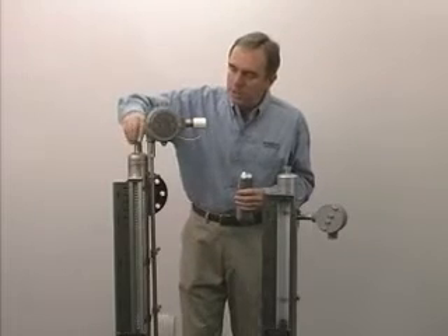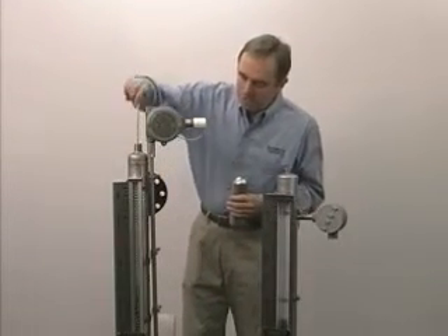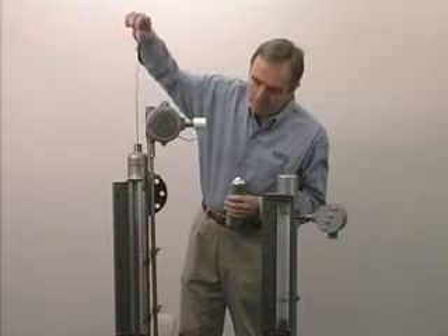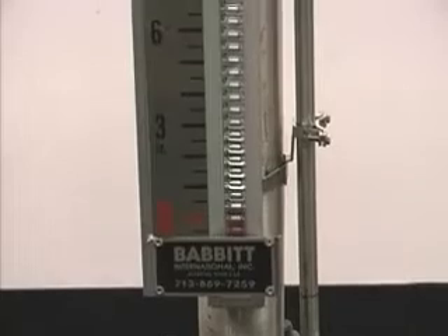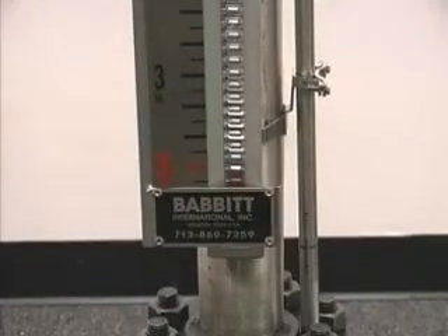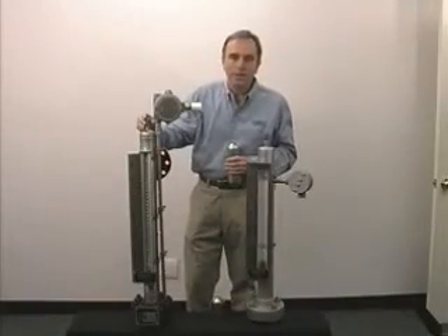Our other indication is a flipper roller. These are the best flippers in the business. They can take very high temperatures, and they change from silver to red as the fluid level rises. They've been tested up to 800 feet per minute on rising or falling levels, and they're absolutely bulletproof. The flipper is made of aluminum, rides on a stainless steel bearing surface, and there's a permanent ceramic magnet inside each flipper.